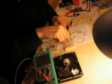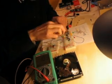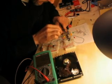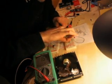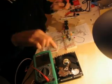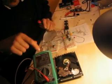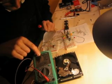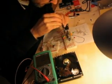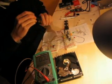I'll show you what happens if I get the boot sequence wrong. I'm going to fire it. And now at any time there are two LEDs lit up. The motor is still responding, but I'm drawing way too many amperes for this motor driver to be happy, so I will have to reset before I fry my chips again.